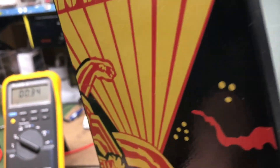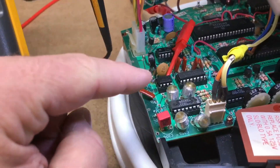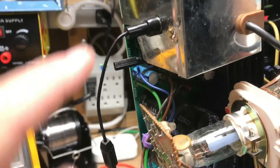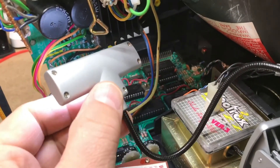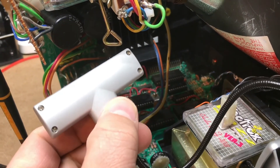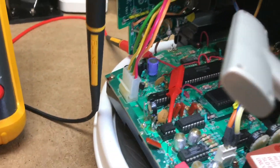Sometimes you can get used to the noise with your ears when it goes in and out, so you don't have to look at it constantly. You can keep the screen kind of to a corner of your eye. Now with our multimeter hooked up — positive lead on pin 1 of IC304, negative up here on the shield for the flyback, which is fine. And I have a good light source right here, just a little clip-on light I stuck on so I could see what I was doing.